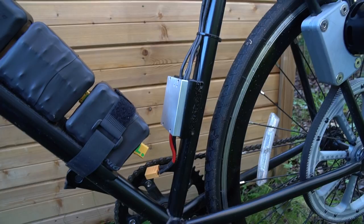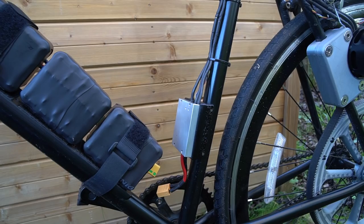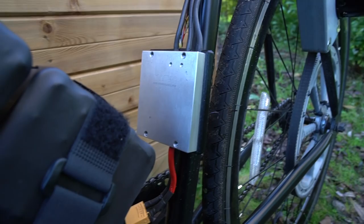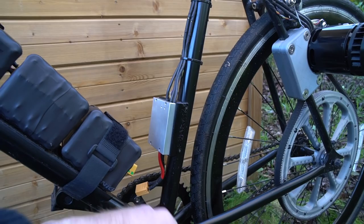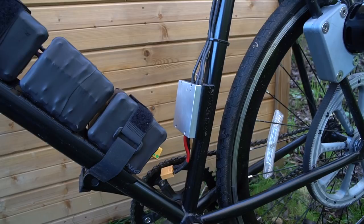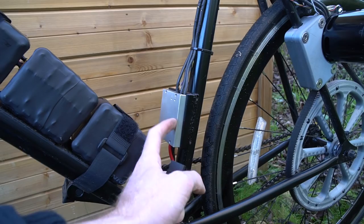As I mentioned before, I have broken 3 VESCs - 3 VESC 4s, which over here in the UK cost £110 each. So if you do the math, that's £330. And considering one of these VESC 6s is £300, I would much rather have gone with this in the first place. The performance is just so much better being 12 cell and 80 amps rather than 8 cell and 50 amps. Going with a single ESC and motor is just so much easier than having the dual motor setup.